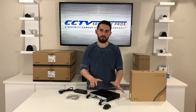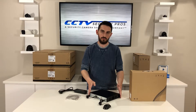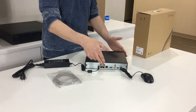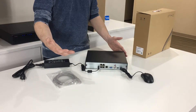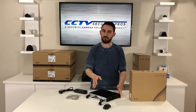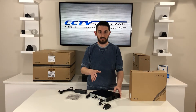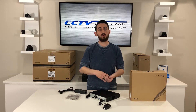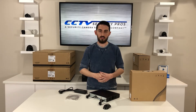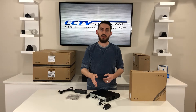The recording resolutions on this are pretty impressive — this is a 4K ready model. You can plug any of your cameras into the PoE ports and it will handle both power and video at up to 4K, recording at 7 frames per second. You could also do 4 megapixel at 20 frames per second, or 2 and 3 megapixel cameras at 30 frames per second. So: 4K at 7 frames, 4 megapixel at 20 frames, and 2-3 megapixel at 30 frames per second.